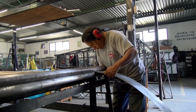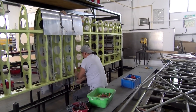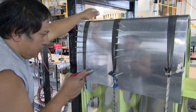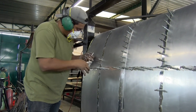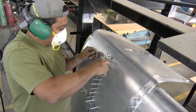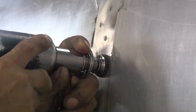Here you see the roller we use to form the leading edge of the wing skins. Then the skins are slid into place and tightened down for drilling. After all the skins are matched drilled to the ribs and spar flanges, they are then removed for deburring and dimpling. Finally, the skin interiors and ribs are painted with the epoxy strontium chromate primer. Afterward, the wings are reassembled with clecos and the finish riveting begins using all flush head rivets. Not a single round head rivet anywhere in the wing — only flush head rivets are used on the wing skins.